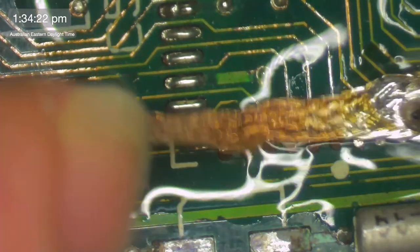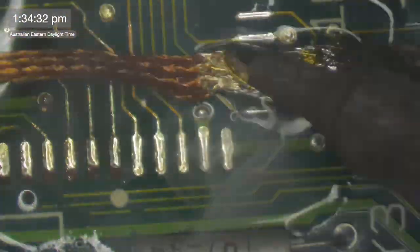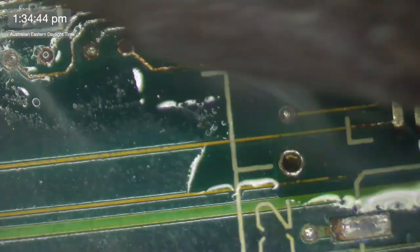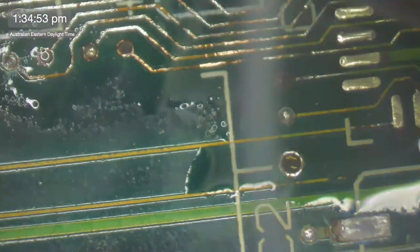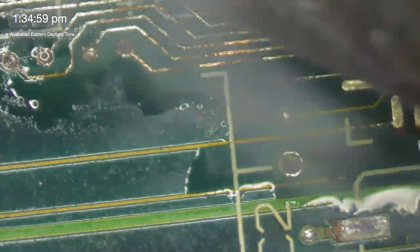This is the revision 2 board. I mean, it might be revision 12 for all we know, but in terms of the ones that got sold, there are kind of three distinct revisions, really. There's the first one that has a bodge wire on it, and then a later revision still has the same problem, but they didn't need a bodge wire for it. They sorted it out. And then the third one is this one, and you can tell this one apart because one of the capacitors is in a slightly different position, and it has the CPU soldered to the board rather than in a socket, and it's grey rather than that gold topped CPU that those earlier ones had.